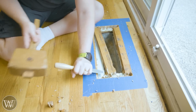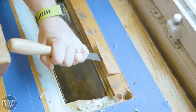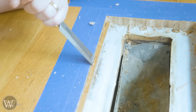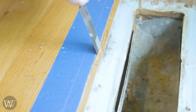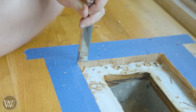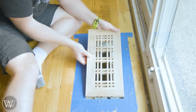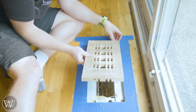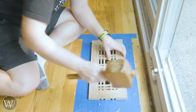Some of these pieces were whole pieces of flooring, and some of them need just trimmed back a little bit more. So we could pry back to what we cut, and putting in that deeper stop cut there allows me to cut in a little bit farther without fear of it splintering back past. And on one of these, right around that location, there wasn't a knot, but a twisted grain where I ended up chipping back off of the underneath the tape. So I had to glue a little piece back in. But at this point, we can test and see how it fits.